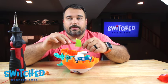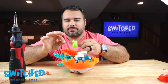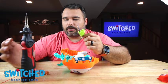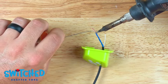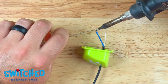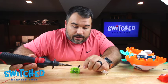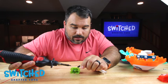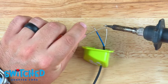The first thing I like to do before I solder the wires to the board is get a little bit of solder on the wires themselves — it just makes it a little easier once I try to get everything into place. So as soon as my soldering iron heats up, I'm going to get some solder on here. I've got my wire, my iron is nice and hot. I'm just going to bring in the solder, touch it to the iron, and almost like paint it on the wire. I am not an electrician, but this is not hard — you can do this. It doesn't really matter as long as it works. This is not rocket science, you can definitely do it.